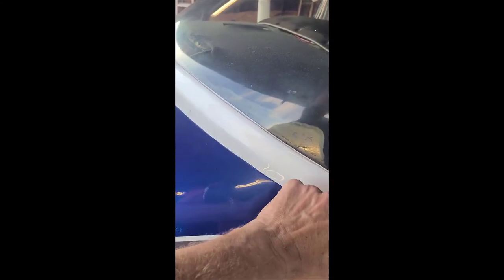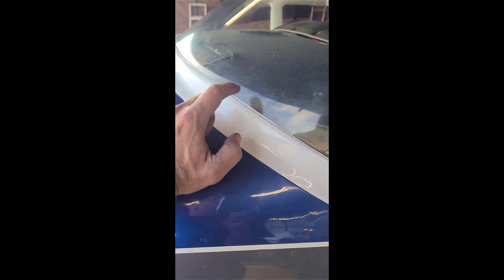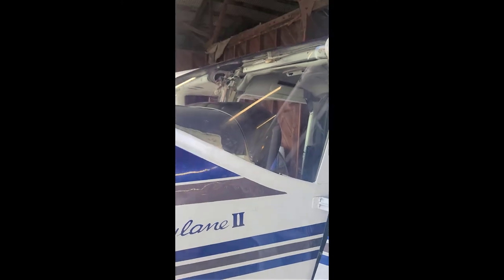Other lessons learned: I still have to get in there and fix the trim — that's just the foam. I wish I would have trimmed it out and fixed that before putting the window in. The problem is that the Naugahyde — the fake leather, the pleather — went down and tucked in the window. I would trim out the Naugahyde so it ends before it touches the window, or make sure it doesn't have a big bead on it. Anyway, I have the solar gray tint and I think it looks fantastic.